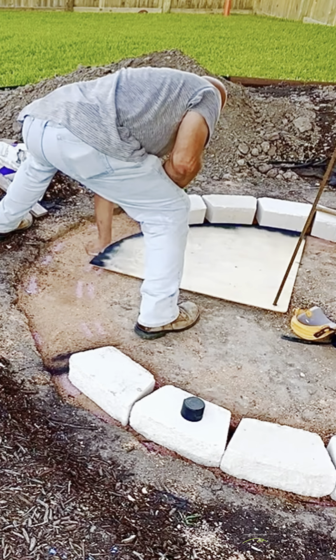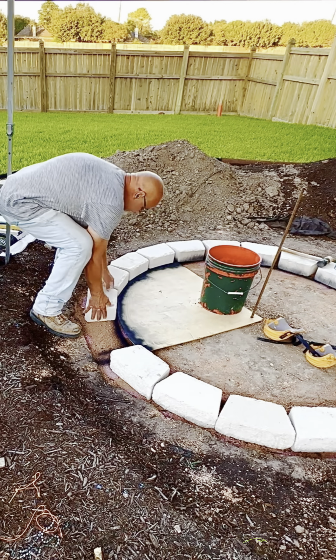As I continued laying the blocks and came to the last one, I realized I had a small gap left. This is what happens when all the blocks vary in length. Making adjustments is just part of the process, so I just cut down the template about 1/2 inch with my jigsaw, put the template in place once more, and reset the blocks. The 1/2 inch I reduced it enabled the blocks to move inward enough to fit tightly all around.